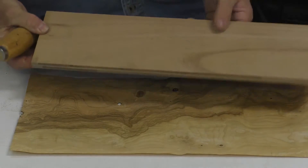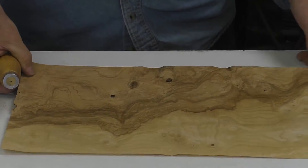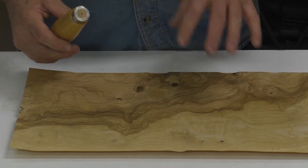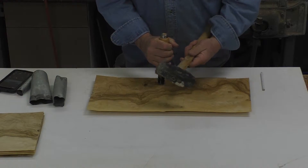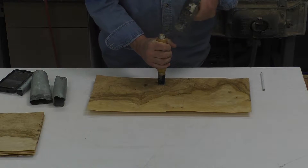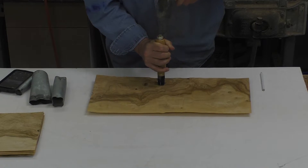I like to have a medium soft piece of backer. This is a piece of mahogany plywood. Poplar works well, even MDF. But you certainly don't want to be pounding into maple, because that will dull your edge pretty quickly. I like to use one sharp blow with a nice sort of sledgehammer. Since this is spring-loaded, I push this down and then just give it a nice solid wrap.